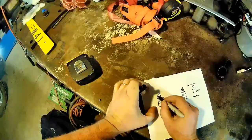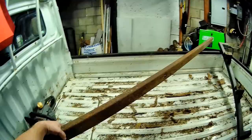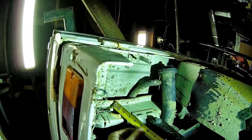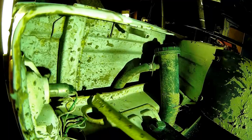Usually I don't even draw anything, but visually for everybody I think it might be better this way. It's kind of a little crusty. I should be able to find some good steel off the end here. I should still be able to cut that hole. How big is that hole? Just shy of inch and 3 quarters. To get around to weld and everything, I need almost a 2 and a quarter inch hole, so I can definitely get flushed against that.